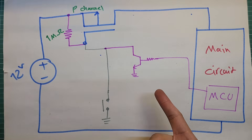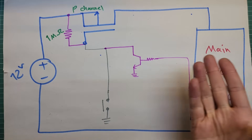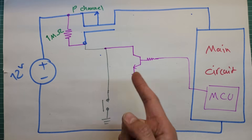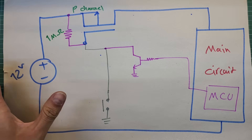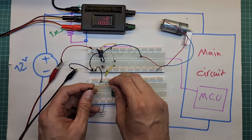So how do we keep the circuit on after the button is released? We can add another small transistor that will pull the gate of the main MOSFET low. Here's how it works: when the user presses the button, the circuit turns on. Once it's on, the microcontroller — which now has power — activates this small transistor, keeping the gate voltage low even after the button is released. The microcontroller can later switch off this small transistor, allowing the gate voltage to rise back up via the resistor, turning the main MOSFET off and shutting down the entire circuit including the microcontroller itself. But don't rush to build yet — even though the circuit looks fine on paper, it most likely won't work in reality.